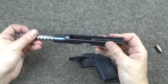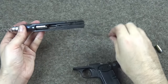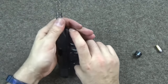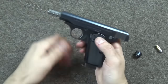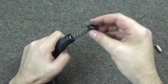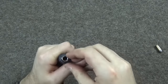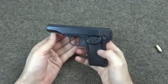So let's put this back together. Put the barrel in first with the lugs at the bottom of the slide, turn them up into the notch — the lugs engage there. Don't forget the striker and spring follower. Take the magazine off, make sure it's all lined up, and pull it back onto the stripping position. We can then rotate the barrel down and in. This needs quite a lot of force to cock. Luckily you can turn it one way or the other and it's engaged when the two notches are up and down. And then we can function-check it. There you have it.